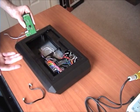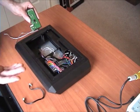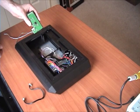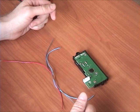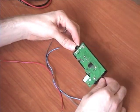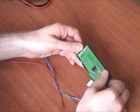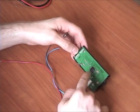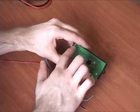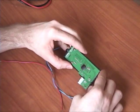Once we have our soldering done, we're basically in the clear and everything else is just tightening screws against wires. What you need for this next step is three wires and the PCB that we took out. You don't even need to remove these screws or open this thing up to do the soldering — you can do it right on the back of the board. So if you've removed all of these connectors and everything, it should be pretty easy to work with.